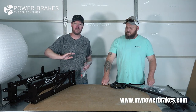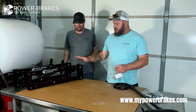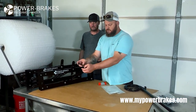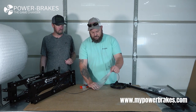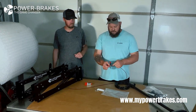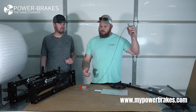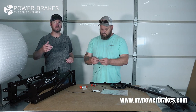It comes fully assembled, ready to bolt onto your boat, also with the clips. Chad, tell us about the accessory pack. So if you just get the brackets, the accessory pack really only has the clamps. We leave the cable loose because everybody wants different lengths — put the clamps wherever you want. We've got some crimps; wherever you want this clamp to be on your boat, a lot of people put it on the D-ring of their battery box or engine compartment. These crimps just slide over the wire, loop it back through, and you crimp it down with regular wire crimpers. Then you have a pull handle — pull it up and clamp it on the engine or your steering cables.